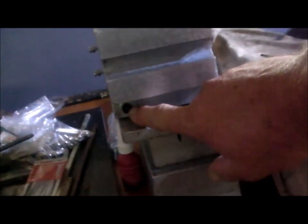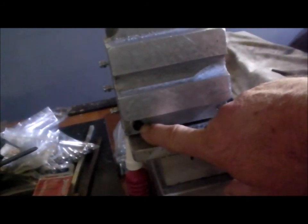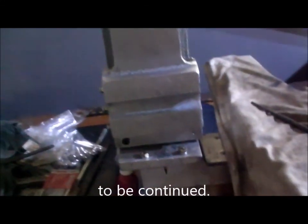The alignment across the back there is now correct. Small mistake, but one I've been able to work around. The three gib screws are in, just needs a little bit of final adjustment. And the lock bolt is in for the ways. It's amazing how that works — doesn't take much to tension that down and jam the spindle head on the ways. Worked quite well. Thanks for stopping by. Catch you later.